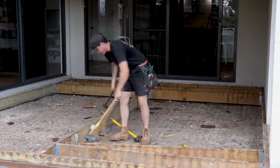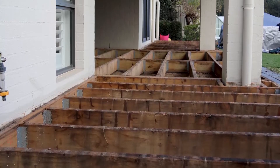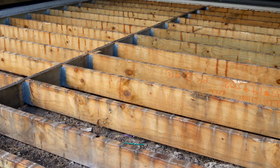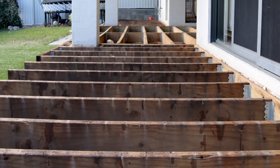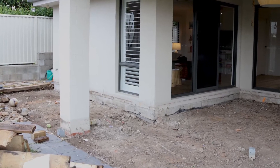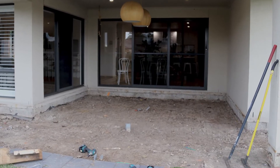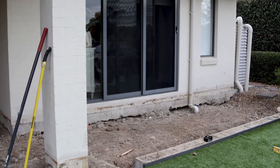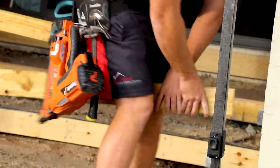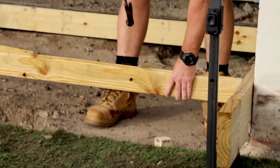It's now time to get up some of this subframe, as there were some parts of this 12-year-old subframe that were never going to last the test of time and were showing serious signs of age and wear. Now that that's all gone, it gives us a chance to check the drainage, any evidence of pests, and to clean up and level out. It is like a spring clean and a great setup for an amazing new deck.